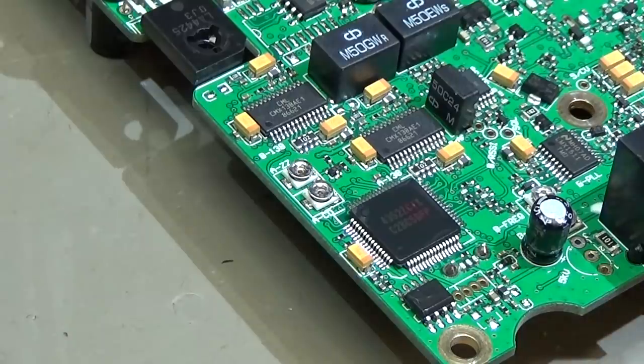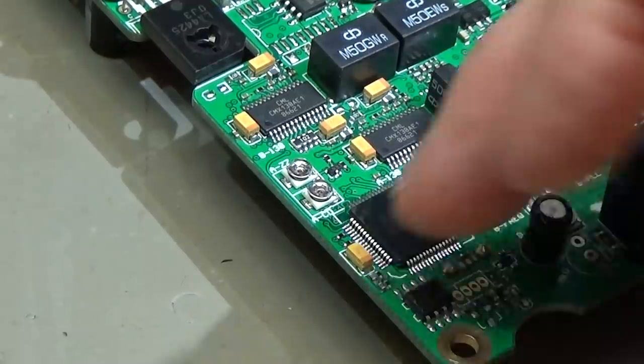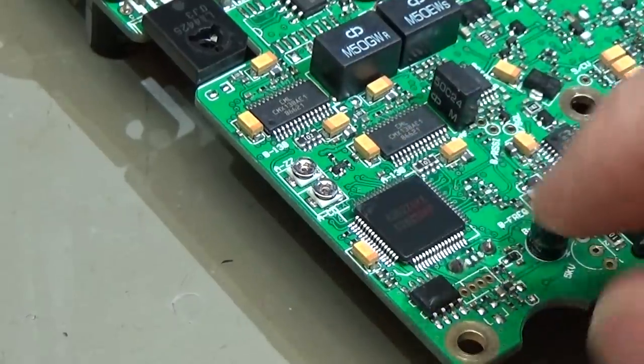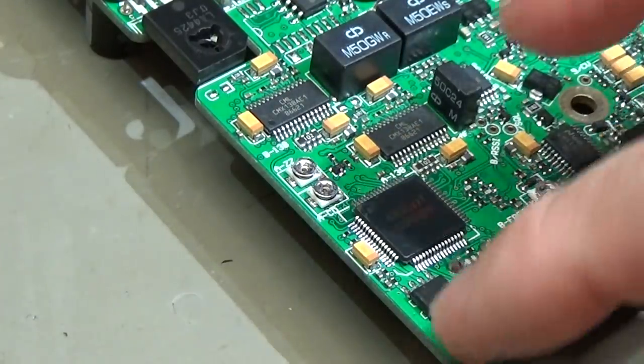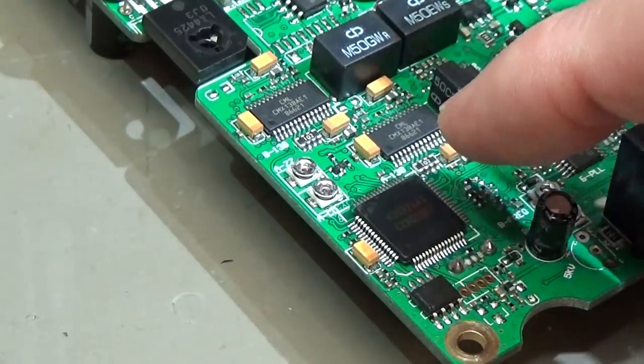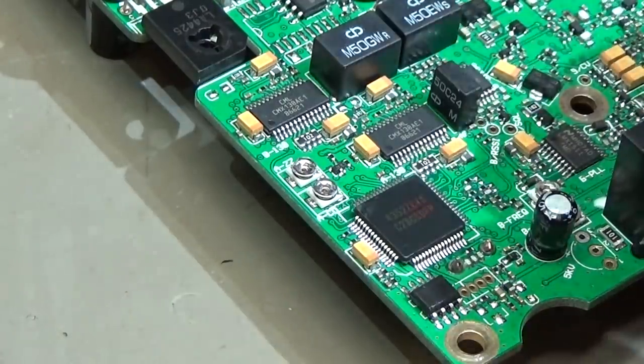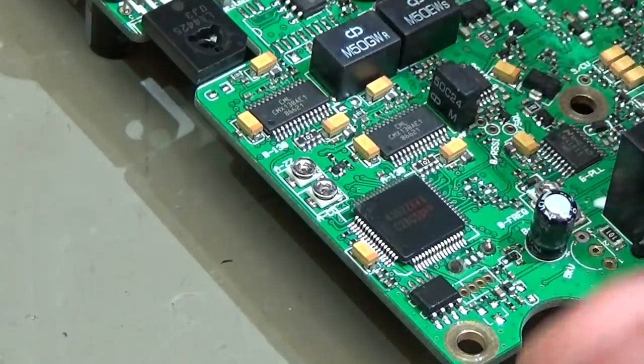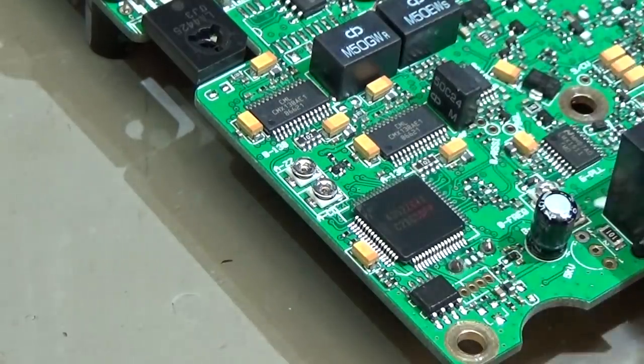For sure, because you can buy these radios for $180 or euro new, including shipping. Additional to that, there is no real supply chain for parts. I mean, normal parts we could use from other sources. But especially the CPU and the EEPROM, we need the data, and I believe in this microprocessor there will be a little portion with software as well. So that means we definitely would need an original part, and there is no part supply as far as I know. So that means it's over. It's definitely over. Very sad, but this radio is toasted.